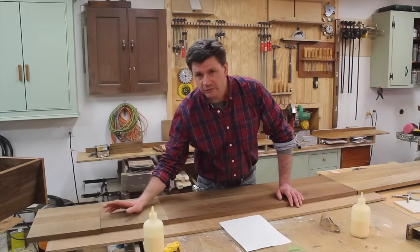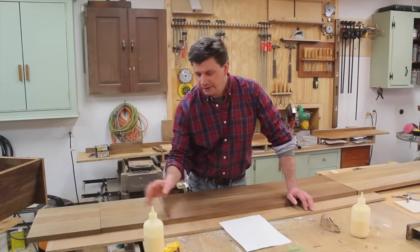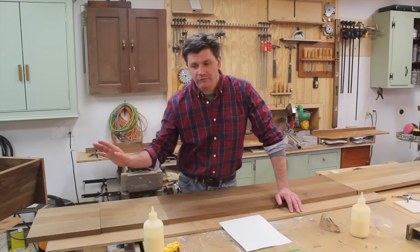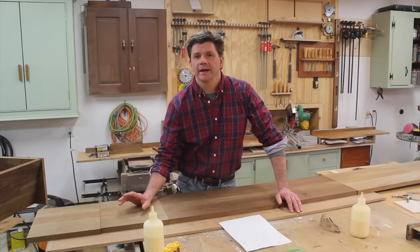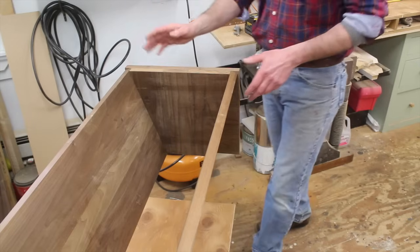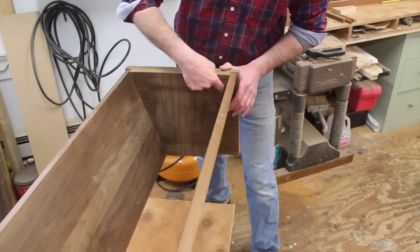If you're wondering about the dark color of the wood, this is thermally modified poplar. The reason I'm using it is because I'm allergic to pine — otherwise I'd build the beehives out of pine. You can get all the parts out of one 1x6x12 and one 1x8x12 by gluing and joining the boards together. I've already joined and cut them to length and width, and the next step is to cut the angles on the inside sides.